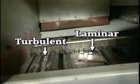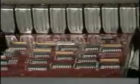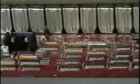Many wave soldering systems use both laminar and turbulent or chip waves. Turbulent waves are used to ensure that all metal surfaces are wet by solder. This is especially important for soldering small chip components such as surface mount resistors and capacitors mounted on the bottom of assemblies. In either case, as the bottom of the assembly passes over the crest of the wave, solder touches the parts to be joined. Although the solder also touches the base or laminate material of the board, it won't stick to these non-metallic materials if they are properly cured.